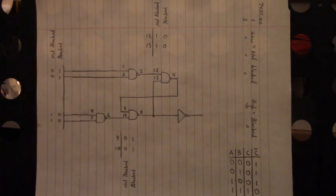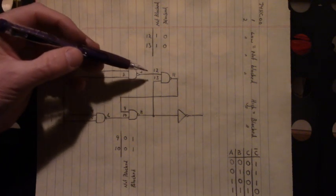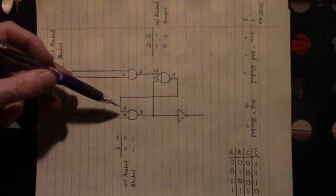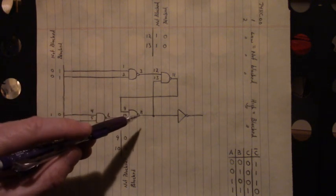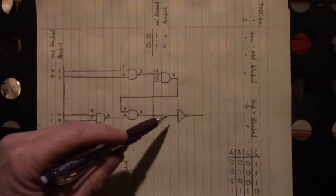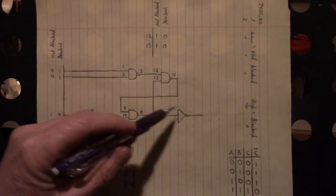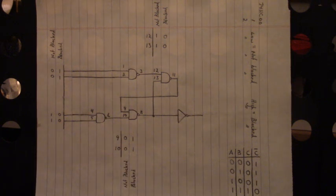All of these states I viewed with the oscilloscope. So we have a high and a high, then we have a low. So we have a low and a low, then we have a high. And that high is inverted. We have a high here and a low here, so the NPN transistor is turned off. And the LED inside that solid state relay will be off.